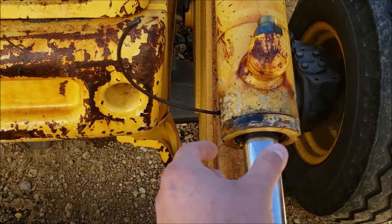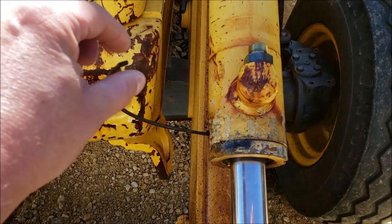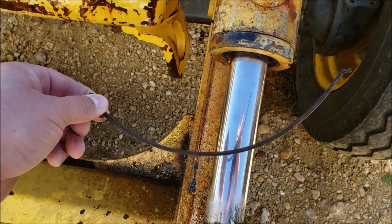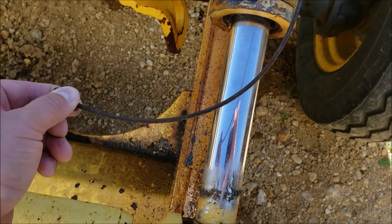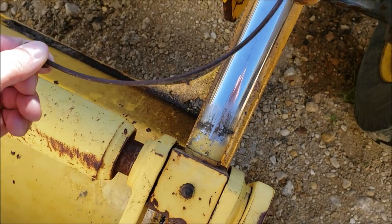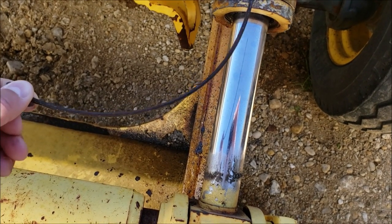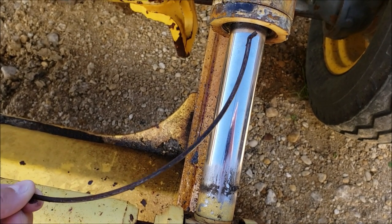I wanted to show you this wire as you're spinning this gland. Once you get it to break free and if you've got the retaining wire type cylinder — this is my New Holland one — this is how big that wire is. It's got to be more than one loop. That thing is just huge. So you've got a good amount to go. As you can see, it's pretty rusty — it's got some garbage on it. Maybe that helps hold it in place. I'm going to try to clean that up real well, the gland in there and the inside of the housing, so eventually if I ever need to rebuild it, it'll move easier.